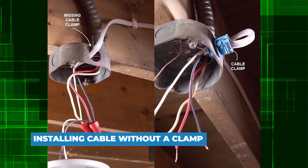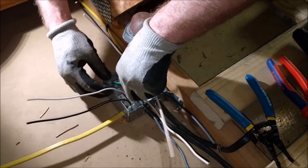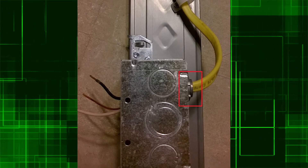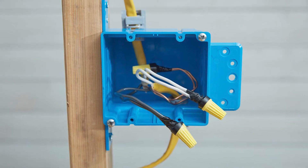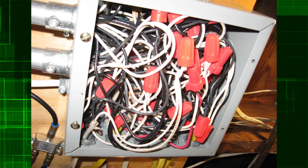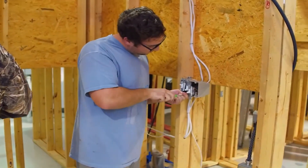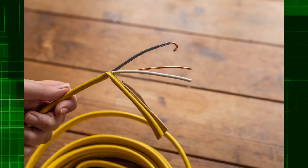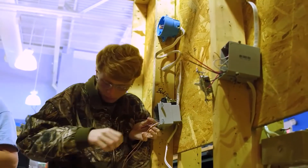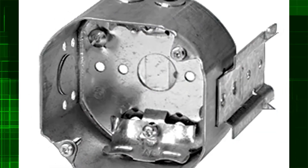Installing cable without a clamp. If cable is not clamped, it can move around and strain connections. If the wires rub against a sharp edge in a metal box, the insulation will be cut. As a result, cables must be attached to the box using an approved cable clamp. Cable clamps are not required in single plastic boxes, but the cable must be stapled within 8 inches of the box. A larger box should have clamps built in, with the cable stapled within 12 inches. Ensure that the cable sheathing is trapped under the clamp and approximately a quarter inch of sheathing is visible inside the box. If clamps are not built in, purchase them separately and install them in conjunction with the cable.